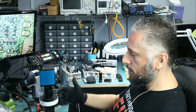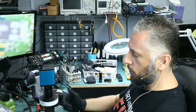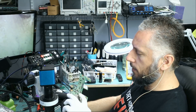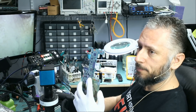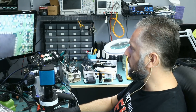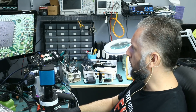In this video we're going to be working on an HP Spectre laptop that came in for no power. Big boss already went over the board and he told me that he found a very hot spot on the PWM IC. I work on those laptops every single day and I never had to change a PWM chip on any Spectre laptop before.